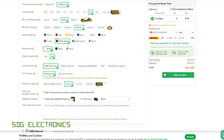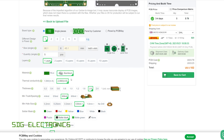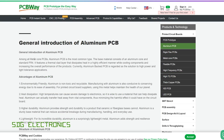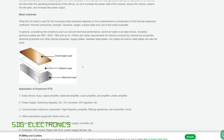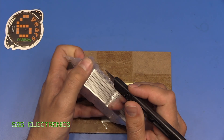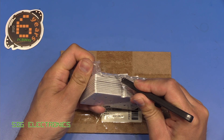With these aluminium PCBs and the higher thermal conductivity we should have much better cooling of the LEDs, and we're going to do a comparison between the two with the sensor that's actually on the PCB. PCBWay has quite a few help pages — this one about aluminium PCBs explains how it's made. When you select the different thermal conductivity option, I assume they're using a different dielectric layer between the copper and the aluminium board — a more expensive thermally conductive dielectric layer. It took around a week for these to arrive after ordering, which is pretty good.